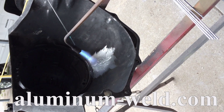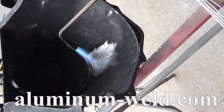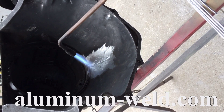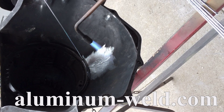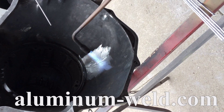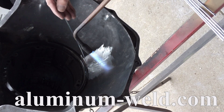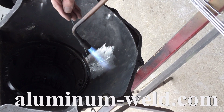The way to do this is you apply your heat and check it with the rod. The aluminum must melt the rod. Be real careful — check it real carefully every few seconds.